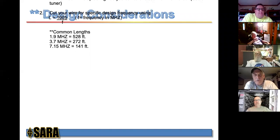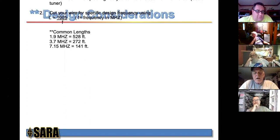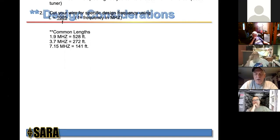Like at 1.9 megahertz, using that formula, you come up with a loop that's 528 feet long. At 3.7 megahertz, it's 272 feet, and at 7.15 megahertz, the design frequency would be 7.15 megahertz, it would be a 141 foot loop. Divide that by four. You could put up a 40 meter loop that's good on 40 meters and higher, and by utilizing a different feed consideration, outlined in that article that I alluded to earlier from QST 1985, you can use it as a vertical antenna on 80 meters.